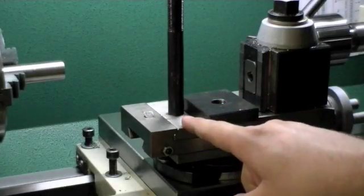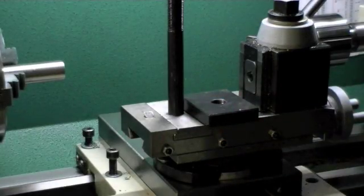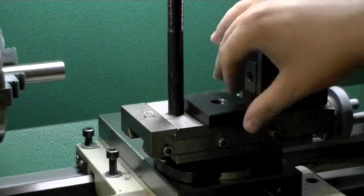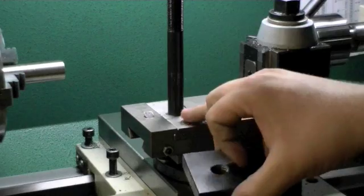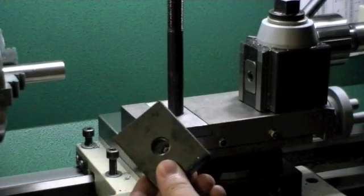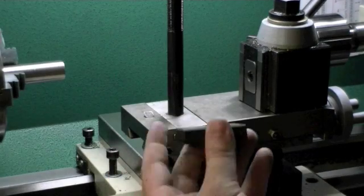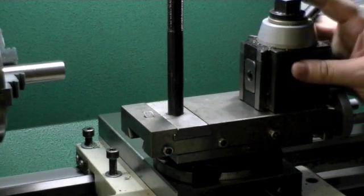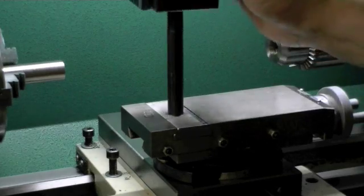If you make your own plate like I did, you're going to need a metric tap — it's an M14 by 1.5 tap — and that's what will allow you to tap the appropriate size hole for this thread. Then once you've got either this plate converted, meaning milled down to the right shape, or another plate made, changing the tool post is as simple as sliding it in place.